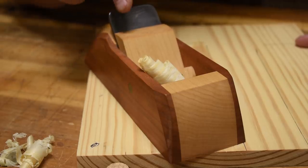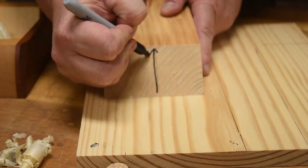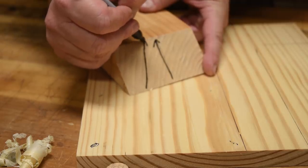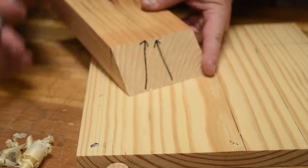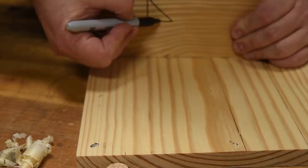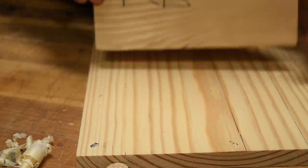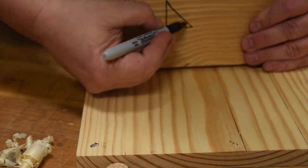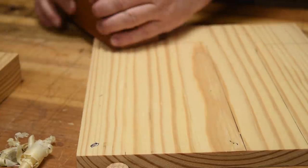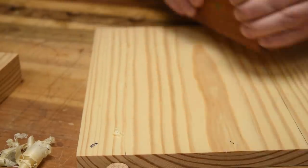Think about what just happened with the angle here. When I'm moving my blade straight across the wood, the wood is traveling up my blade a certain distance. If I were to skew it a little bit, now this wood is traveling a much greater distance. And if you understand triangles, if you have the hypotenuse of one triangle longer than the other, and the distance traveling up is the same, this angle right here has to be lower. So in effect, by me planing all my stuff at a slight angle, I'm no longer planing at 45 degrees — I'm planing at a much lower angle.